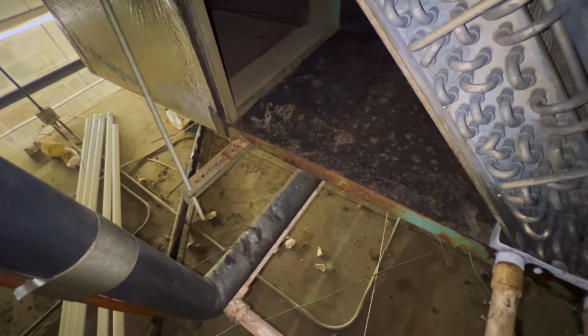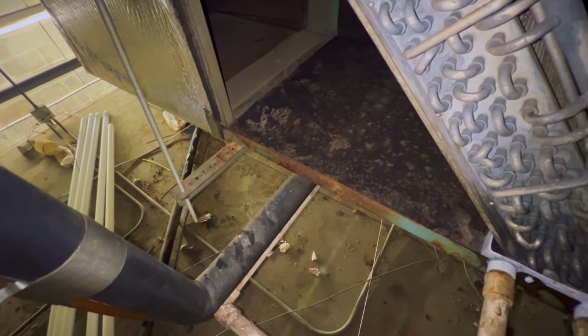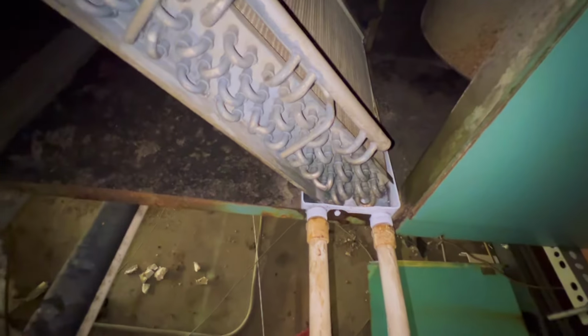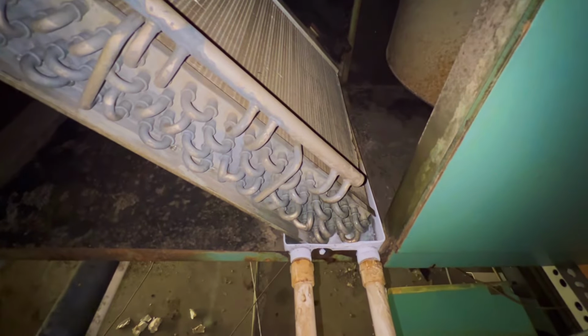because I thought I had a stopped up dryer, but I seen my suction in the vacuum and I started adding gas and my pressures went up, my suction line started sweating and all that. I said, yeah, it's low on gas. Got to be a leak either outside or at this evaporator. So, yeah, I ended up finding it quick. It's blowing.